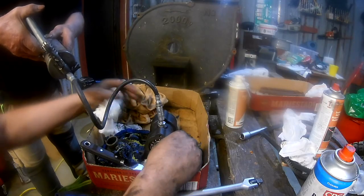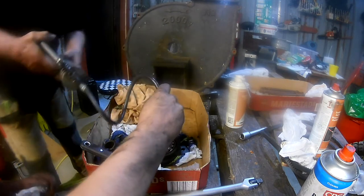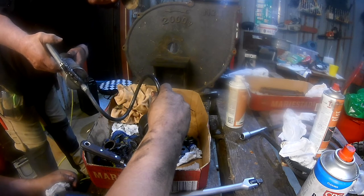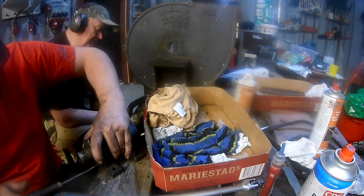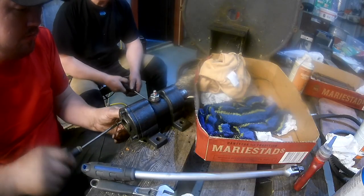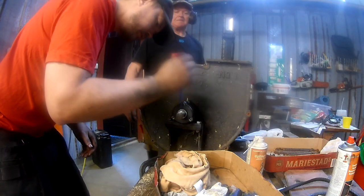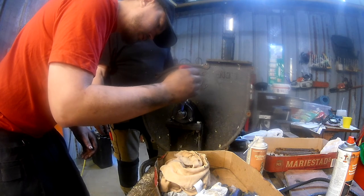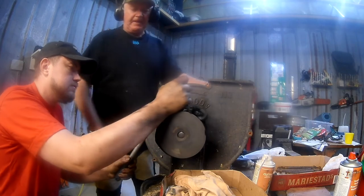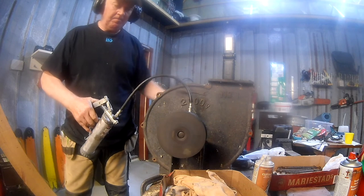There is a felt seal in the lids. I missed one because what I could get hold of was too thick, but a scissor could just trim it down to slightly thinner dimensions. Before putting things together we added grease until we could see grease coming out of the bearings. The lids were put back on — a little tricky getting all the bolts in and getting the spacers and felt seal in place, but it's good enough. Then some thread lock on the threads, the belt added, and a tiny bit of extra grease.